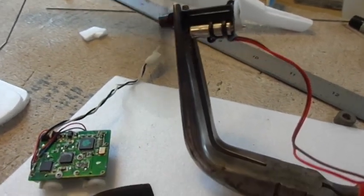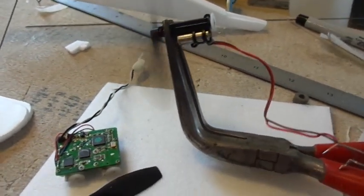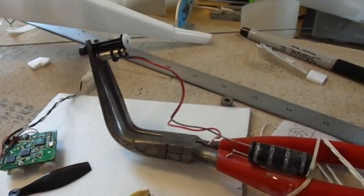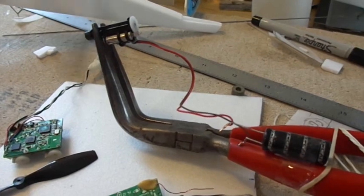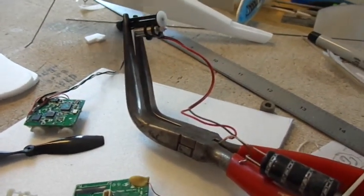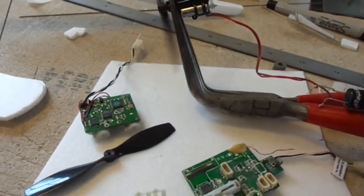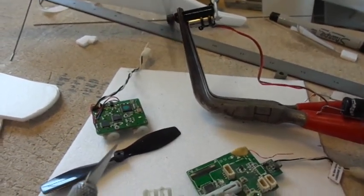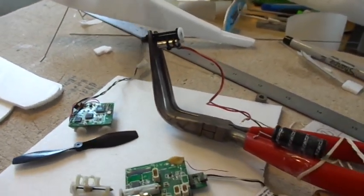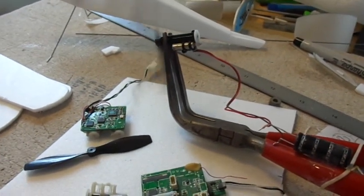All of this equipment was designed to run on a single LiPo cell at 3.7 volts. With a capacitor at 2.7 volts, it's getting a fair percentage of its original designed output power — not near full power, but still about half power, and that's usable. So if you want to adapt equipment from toys for use with a capacitor, try to find toy airplanes and things that run on a single LiPo battery — those are the ones that are going to work for you.